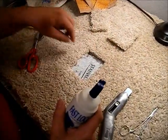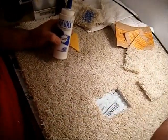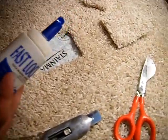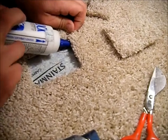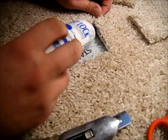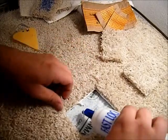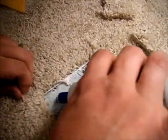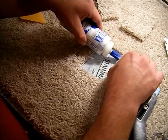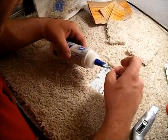Now that we have our dry fit complete, the next step is very important. We are going to seal our seam edges — both in the void and in the bonded insert. This is a very important step. It makes certain that these face fibers right there aren't going to fall out when traffic walks across them. So we have to do this step. Even good installers sometimes skip this step, but we don't skip that around here.